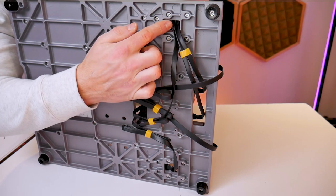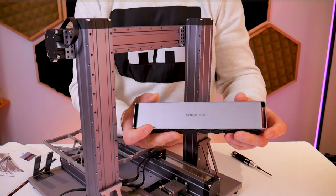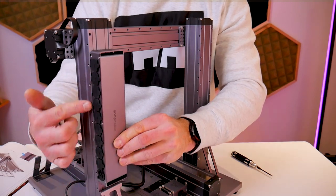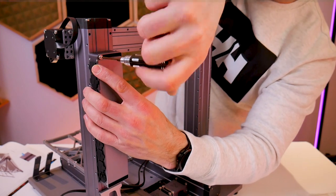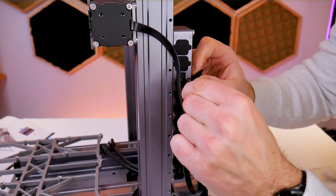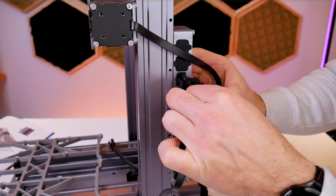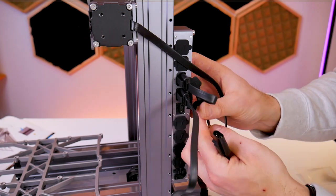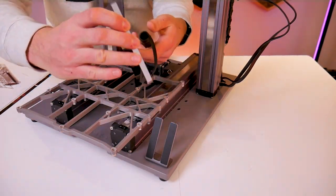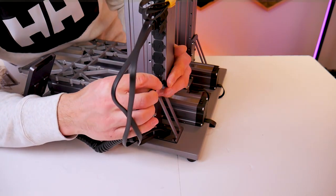Once cables are in general position I took a little more care with cable management using cut-to-length Velcro tie wraps — I'll put a link in the description. They're great because they're soft and non-abrasive. Next, the controller gets installed on the back of one of the Z-axis linear modules using M4 by 30 socket head cap screws through those slots — don't over-tighten. Each receptacle on the side has a dust boot. Pull back the third from the top labeled X and plug in the X-axis module; below that is Y, and below that is Z — plug in all those cables. Then find the touchscreen in the touchscreen box. It sits on the magnetic holder at the front of the base and connects to the controller with a USB-C connector.